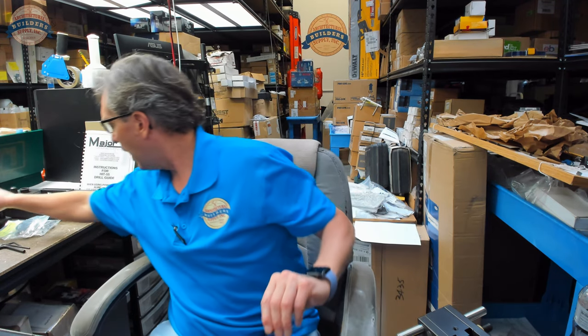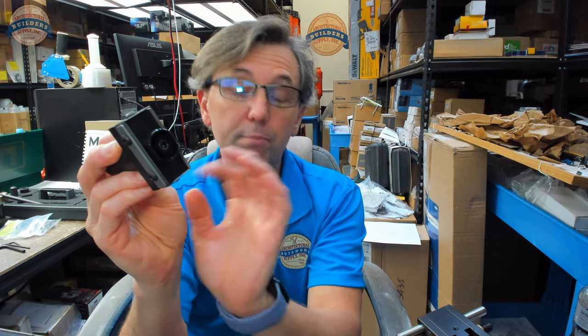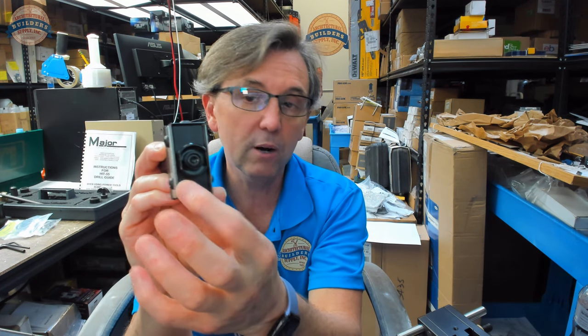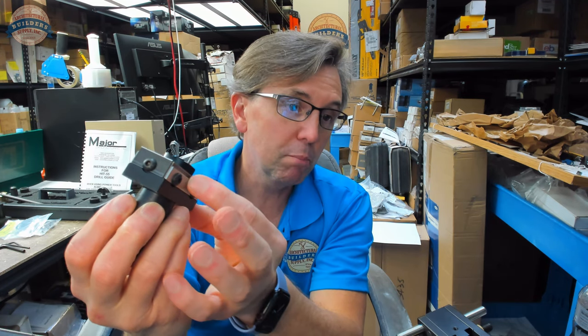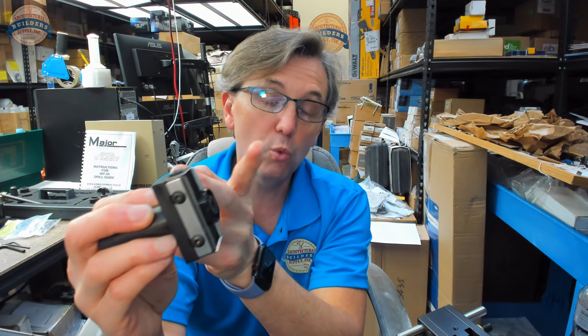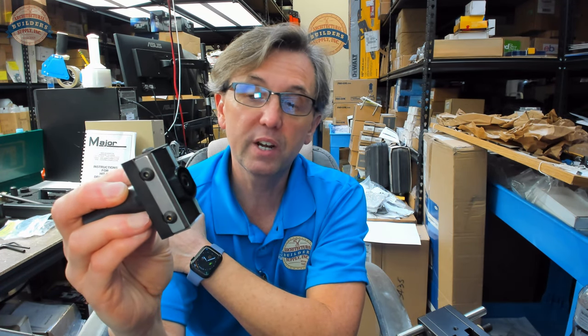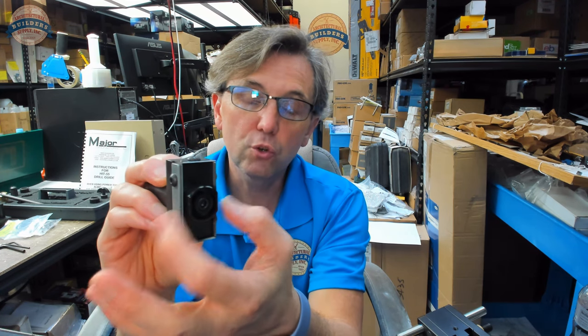We went over the three that are included. I had said earlier that I didn't know if that was 1 inch or 1 1/8. It's really both, meaning it's set to 1 inch right now. You will remove these screws. You will take this shim plate off, this silver piece of metal. You'll stick it underneath the cutting edge, and voila, you have 1 1/8 wide. So 2 1/4, 1 inch or 1 1/8.